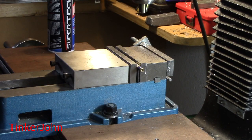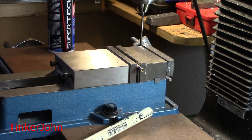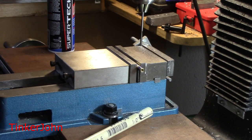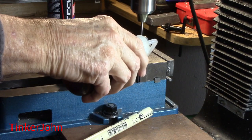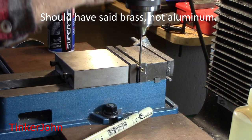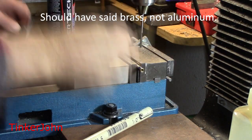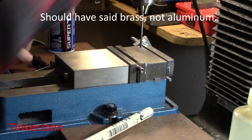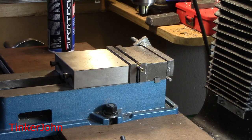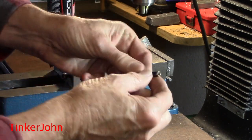I've just got through drilling the hole. The next thing I'm going to be doing is going in with a one-eighth inch reamer, and I'm tightening it up in the drill chuck. I'm going to run this fairly slow — I'm using cutting fluid A9, which is a specific aluminum cutting fluid, and it works really well on aluminum. Clean the reamer off and see the finished product. It's just a perpendicular hole, and you just have to make sure it's all the way through.